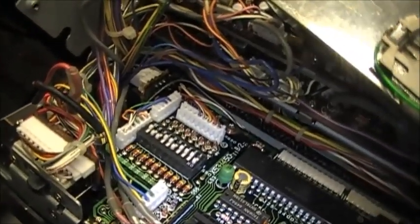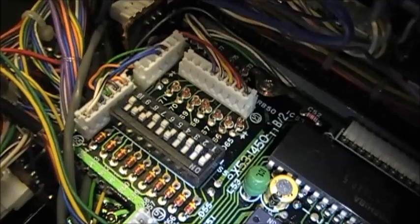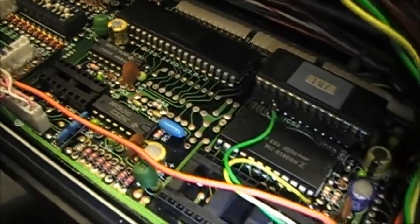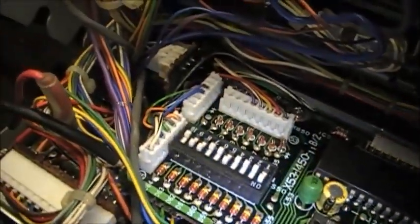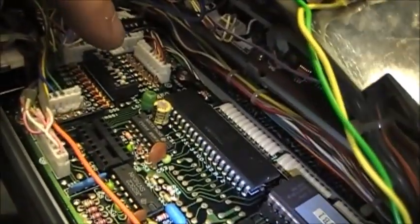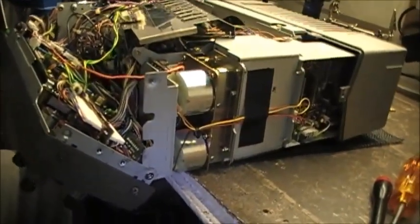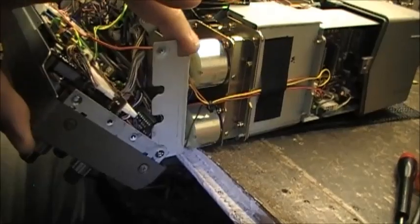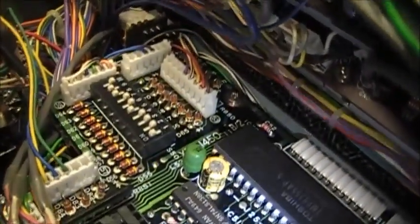The R5000, now that radio has a button for fast scanning through the band. Unfortunately, the TS440 doesn't have that feature. I don't know if there's any way that can be added. It would be cool. I don't know if anybody's ever come up with that modification, or even if it's possible. But anyway, I'm going to solder my D66 back in the circuit here and reassemble my radio. And you will notice how I have my radio sitting. You remove it and she kind of hinges like that. That's how you want to sit her on your bench. Anyway, less talk, more soldering, hey?